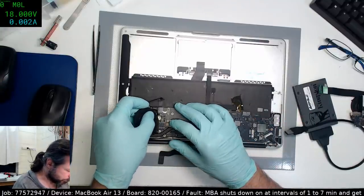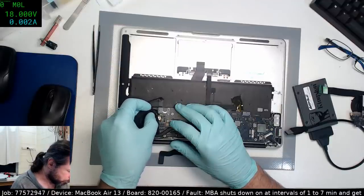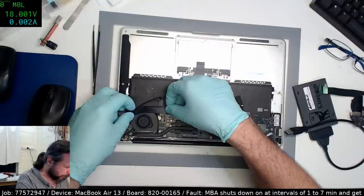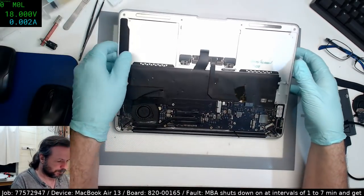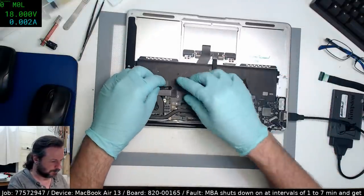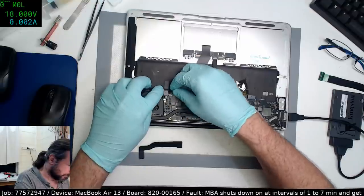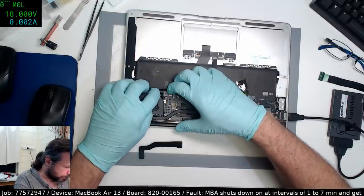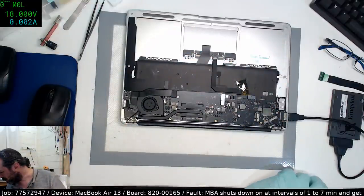Yeah, Pionov, that's what I was just saying, that it was throttling, yes. It was blowing the fan hard and it was throttling. But I was just wondering whether that's part of finding out the cause of these sudden and complete shutdowns, the fact that the SMC is running in a different state. So it could be a case that we do just have a dodgy SMC. Or we have a sensor that's doing unmentionable things to the SMC.